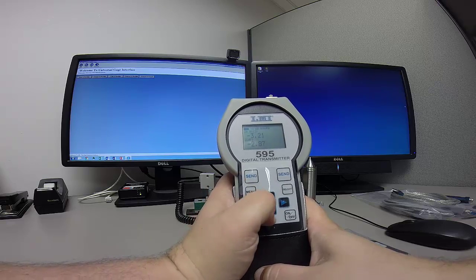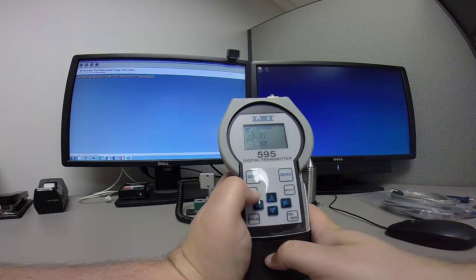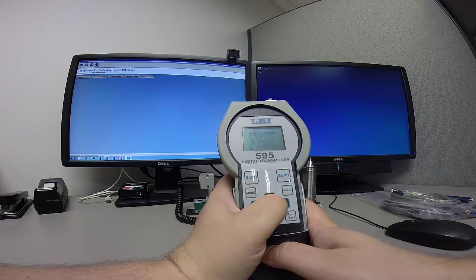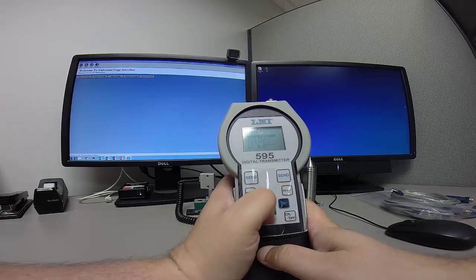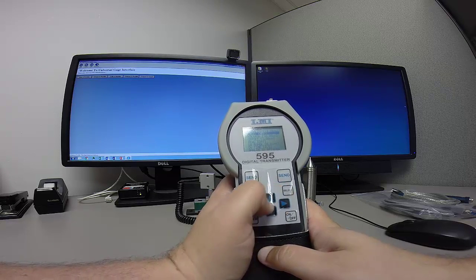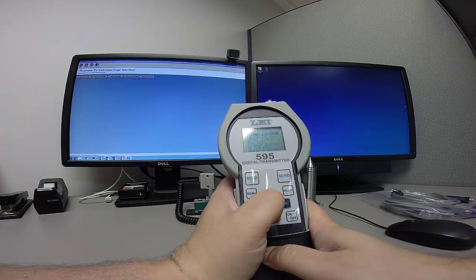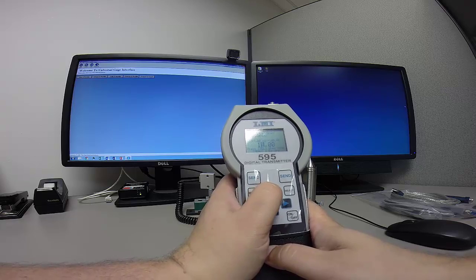I'm going to repeat this process now with my 2B axis, which is currently reading as 2 gap. So I'm going to go to Menu, Advanced Setup, Config Ports, and then arrow down to 2B. Instead of having this one say gap, I want this one to say B-axis. Hit select to save it. Change my cal span again. I'm going back to 4 mils.